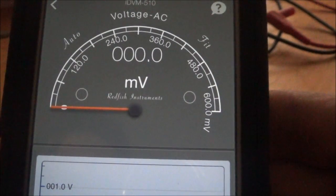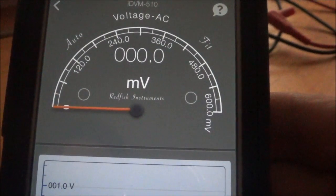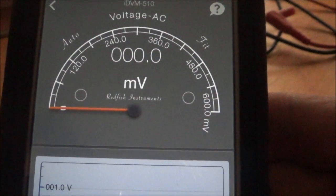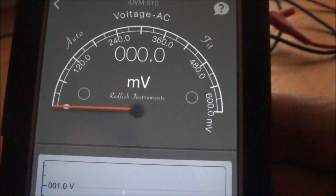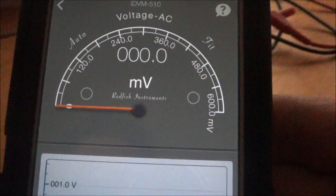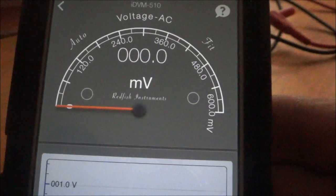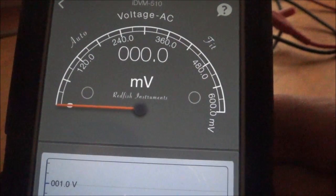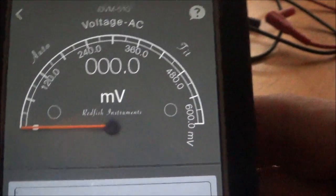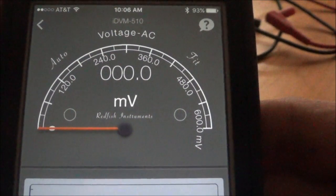I'm beginning to wonder, and I've used different millivolt AC current clamps. I've used the Fieldpiece, and I've used this one. I've used the ACH4, the ACH3, they're all millivolt AC conversion. You know, 1 millivolt equals 1 amp. And I'm running 2.4 amps on this line, and it's not working. So it wasn't the firmware. So I'm going to have to contact Redfish again and ask them,